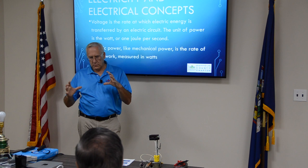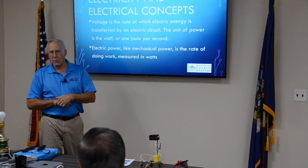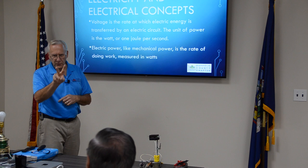Amperage. There's a formula for that, correct? It's like if you use a 1800 watt blow dryer on 120, that's going to give you the amount of amps that you need to run that. We're going to go over all that later in the program, when we do formulas on the board. You're going to be an expert on formulas. You're going to learn two formulas today. Any other questions on that? You clear on that?